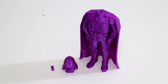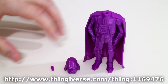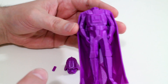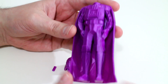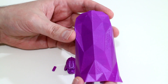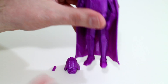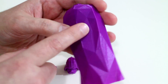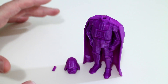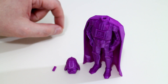And of course, if I'm going to print a Stormtrooper, I'm going to print Darth Vader. And here he is. This is the Darth Vader body with cape, his head, and the head connector. And just like the white PLA, the purple has come out just as nice. It has that nice glossy finish, which really does make the plastic look fantastic. One of the downsides with my 3D printer and glossy plastic like this is on my Y axis — any Y axis moves really shows the oscillations or vibrations that my printer produces. My X carriage has no oscillation problems whatsoever, but my Y carriage is riddled with them, so I'll definitely be looking at upgrading my printer very soon to fix that.